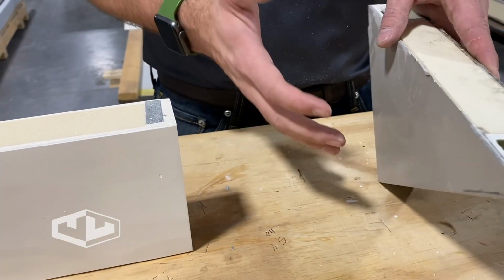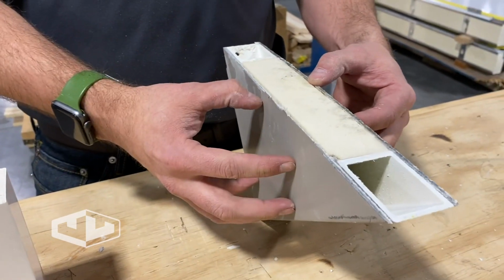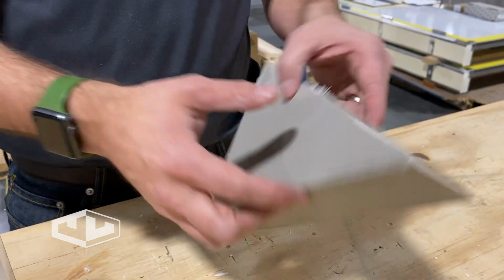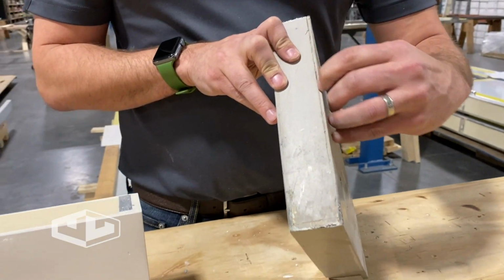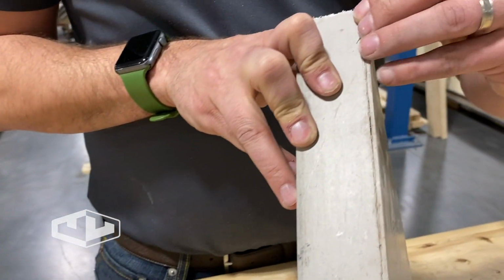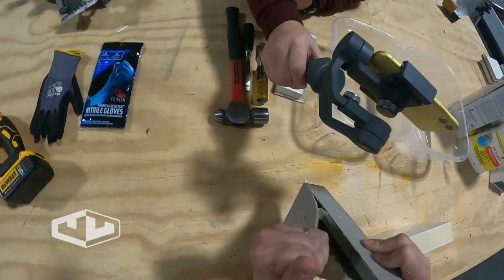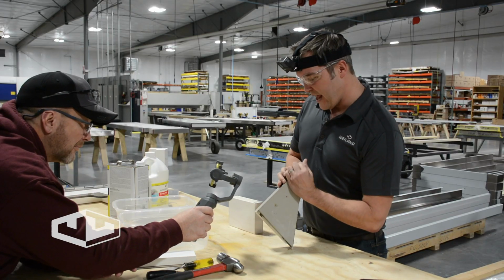So you spray something, let's say this is 34 degrees over here and this is 72, and then all of a sudden this gets hit with something that's 170 degrees. If the rate of thermal expansion in this resin and this resin are different, it causes delamination. So you can see delamination occurring all around this door where this crack is here. So that's kind of what happens.